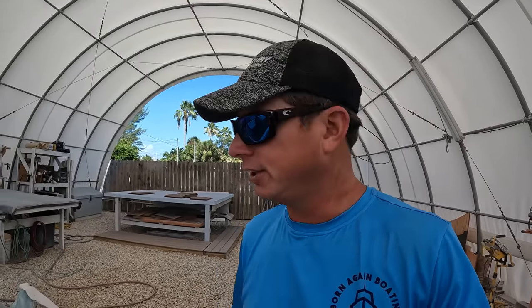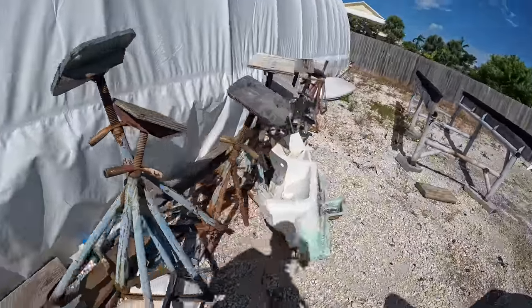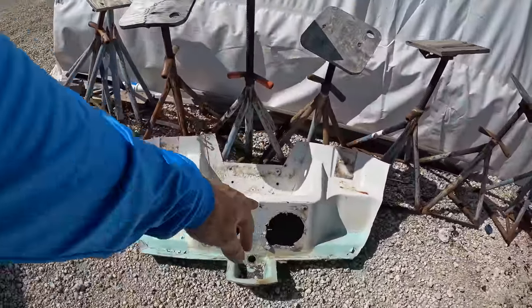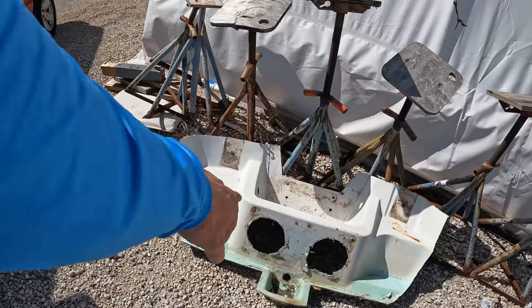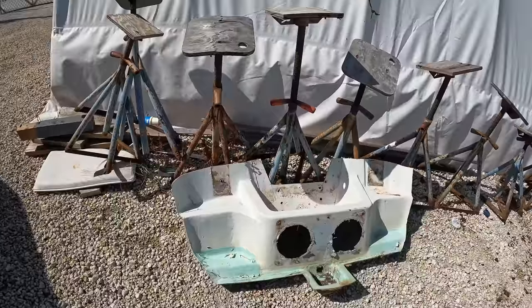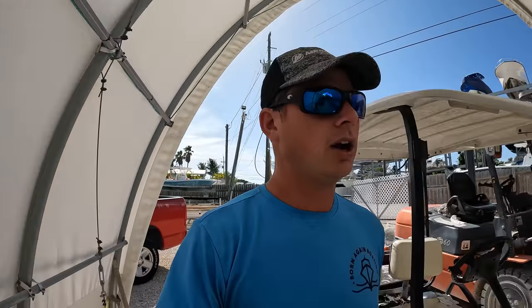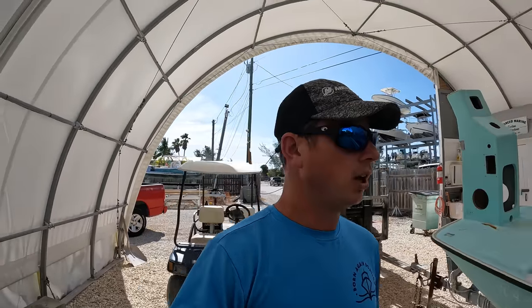And it doesn't have to be completely pretty all the way, because again, there's going to be the transom piece that goes here, and that's really the structure of these little 13 whalers, is actually this piece that's over here. That is more of the structural component to the transom. So this is going to actually be covering. This is going to need a lot of work to clean that up, but that's going to go over the coring that we put in there. So it doesn't have to be 100% the prettiest thing that we do. We're not going to fair it or anything like that. We're just going to glass it so it's structural, and then once it's glassed in, that piece will go over the top of it.